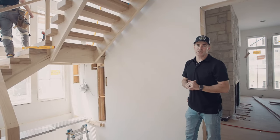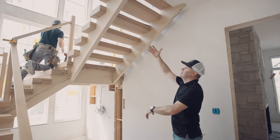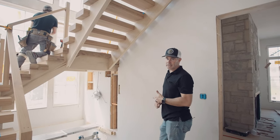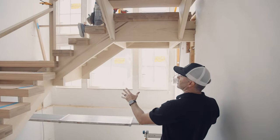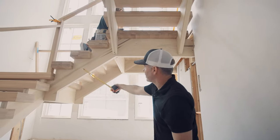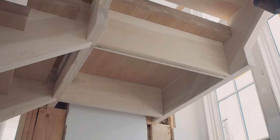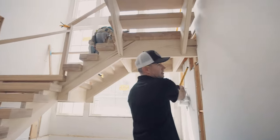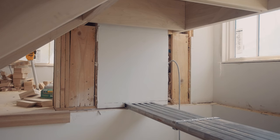Here you'll also notice our stringers. We've got exposed stringers at the back of the stair. Not only are they exposed, but they're true structural stringers — not decorative. This stair is basically all hung off this structural stringer right here, and that's all one piece. It's glue-laminated up, glued together in the shop so it's structurally strong. It sits inside that wall on a leg and inside this wall on a leg, and it's legged down to the deck so that stair won't fall.